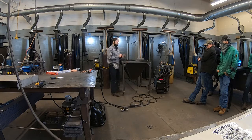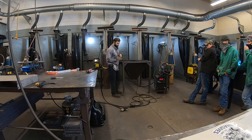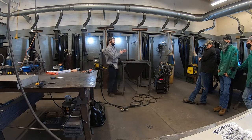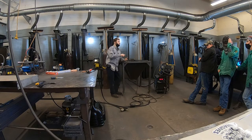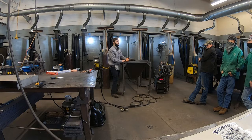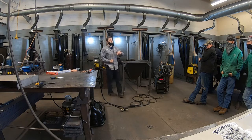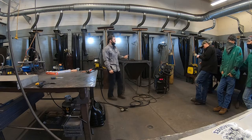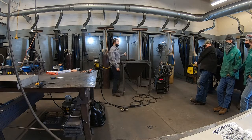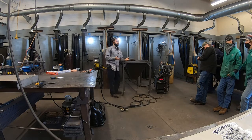I have a piece of welded plate here. The X-plates you guys are currently working on — this is going to be the next step. Once you finish that flat, horizontal, vertical, and overhead on those X-plates, build those all the way up, and then we're going to cut it. We'll do an etch test to see how good the penetration is, and then we're going to carbon arc the rest back out. This is almost like a simulation of a repair weld — say this was cracked, or we needed to re-weld it, we would back gouge it, remove all that material, and put new welds on it.